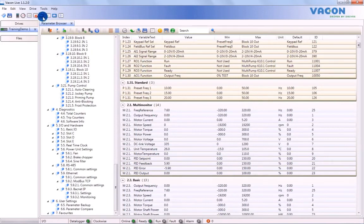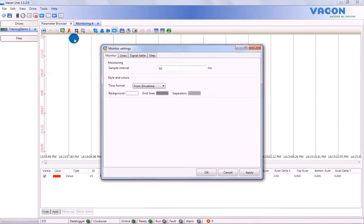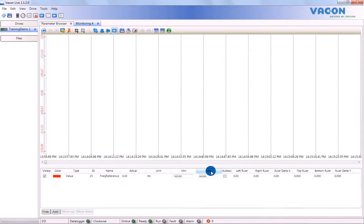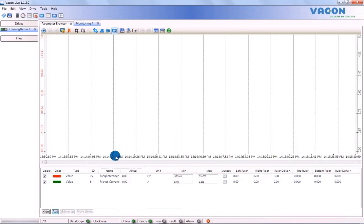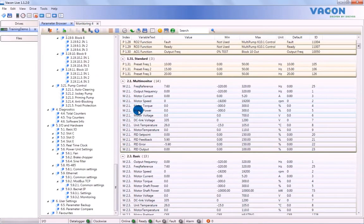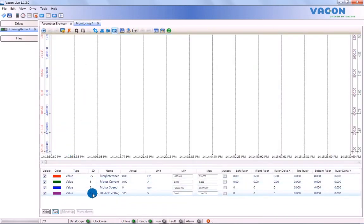Through VaconLive, you can view monitoring trends for set periods of time. Simply open the monitoring window, go to Settings, and set a suitable sampling interval and time format. It can either run in real time, known as drive time, or start from zero when the monitoring begins. To monitor a number of separate values at any given time, simply click Add in the bottom left corner of the screen and select the parameter or value you wish to monitor from the list. You can also send signals from the parameter window to the monitoring window by clicking with the right mouse button and selecting a pre-existing monitoring window from the list, or by creating a new window. You can show as many signals as you like, and they can be added to any monitoring window open.